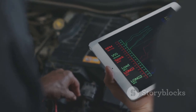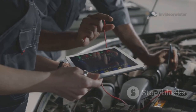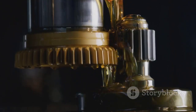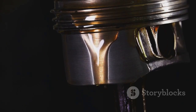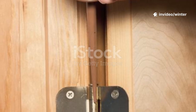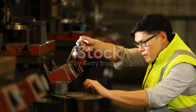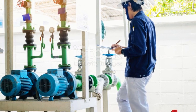Time-based schedules are common, but condition-based monitoring, like ultrasonic analysis, prevents both under and over lubrication, optimizing maintenance. The right lubricant in the right amount at the right time is key to extending bearing life. Neglecting lubrication is the fastest way to destroy a bearing, leading to costly repairs and downtime. Make lubrication a priority, not an afterthought, to ensure long-term reliability and efficiency. It's the cheapest insurance for pump reliability, safeguarding against unexpected failures and ensuring smooth operations.